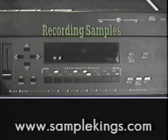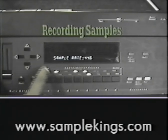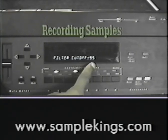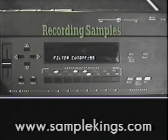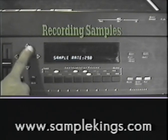Before you proceed, there are a number of sampling parameters that you can adjust. These parameters are accessed by pressing the left and right arrow buttons while in level detect mode. These parameters are, number one, the sample rate, or the number of times that the EPS samples a sound into its memory. Number two, the filter cutoff. This cutoff frequency is of the anti-alias input filter. This filter gets rid of anything above the cutoff frequency. So when you change your sample rate, the EPS automatically resets the filter cutoff to its optimum level.